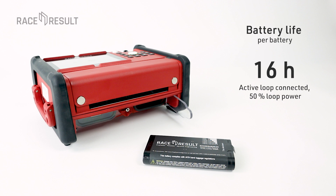With a passive ground antenna connected with a standard length of six segments — so 4.6 meters — you can expect around six hours of battery life. With two batteries, double the time.